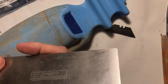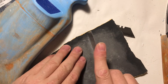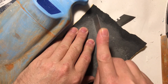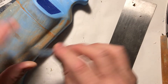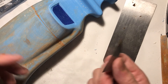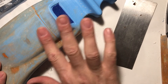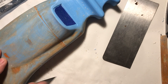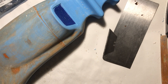If you want to go full hog, get a cabinet scraper — they're not very expensive. To keep the edge sharp, just put a piece of sandpaper on a flat surface and rub the edge over it; easy as pie to sharpen. Or, like I said, just grab a razor blade — it'll do the same thing, and when it dulls up on you, throw it out and get a new one; they cost almost nothing. Both of them will give you baby-smooth surfaces and get rid of those layer lines in seconds. It has limited applications, sure, but where it works, it works really really well. Just a little finishing tip.